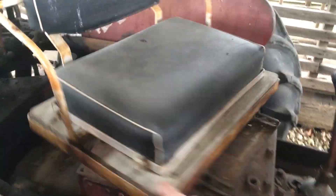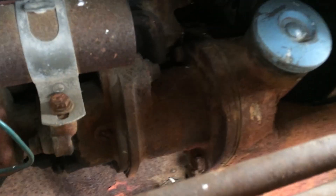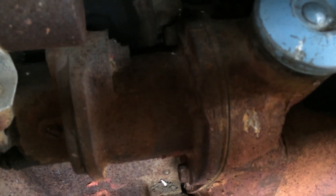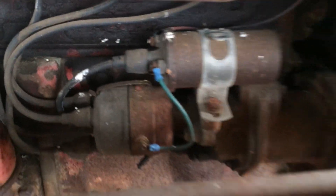I'm still trying to figure out the hydraulic pump on my conversion. It's got a seat that swivels around to run the backhoe, but if we look up here, it does not have the standard hydraulic pump — it's just got a spacer right here. I don't know if this was just an earlier model, but remember on our tractor there's the pump and then right after it's the distributor. No pump there.